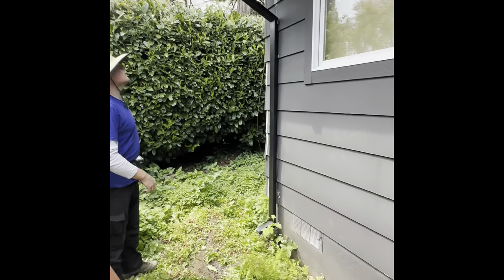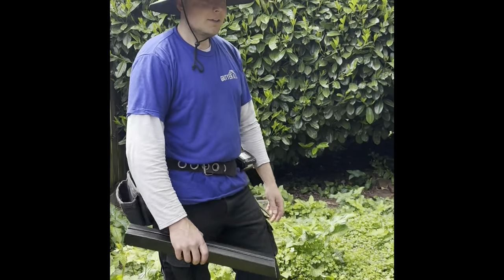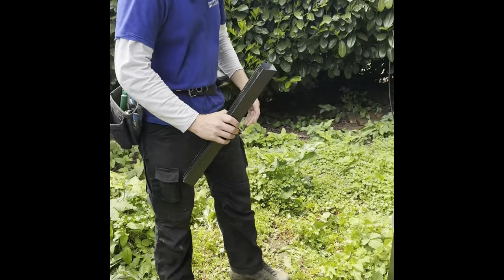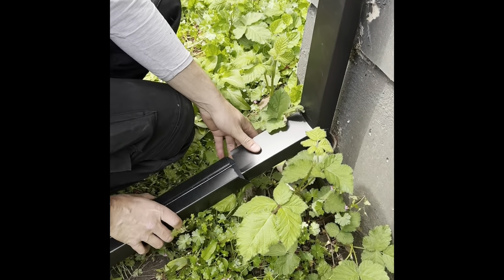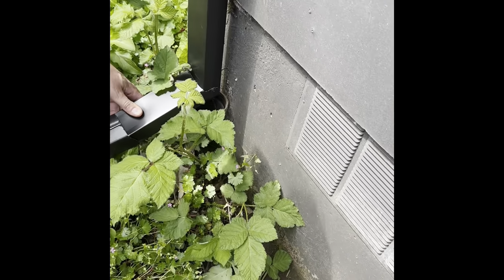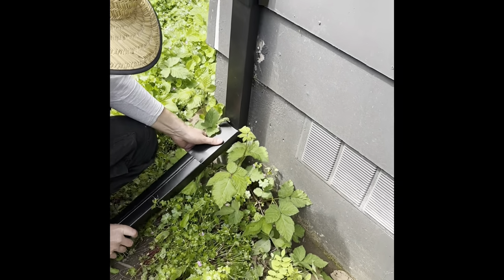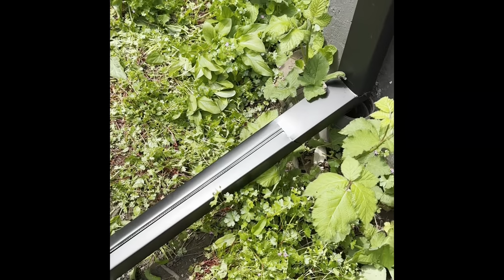One more strap. Make sure it's straight. Beautiful. Hey, Slav, what do you got there? A little baseball bat. Boom. Just kidding. That would be our additional piece to kick the water out further away from the house, from the foundation. Gotta wiggle it. You gotta be on the safe side when it comes to water damage.